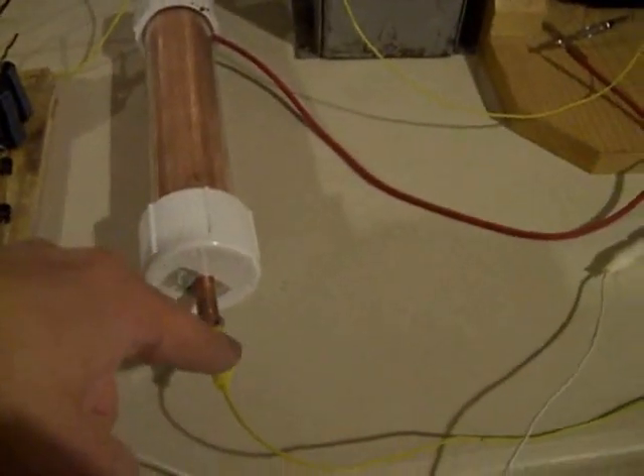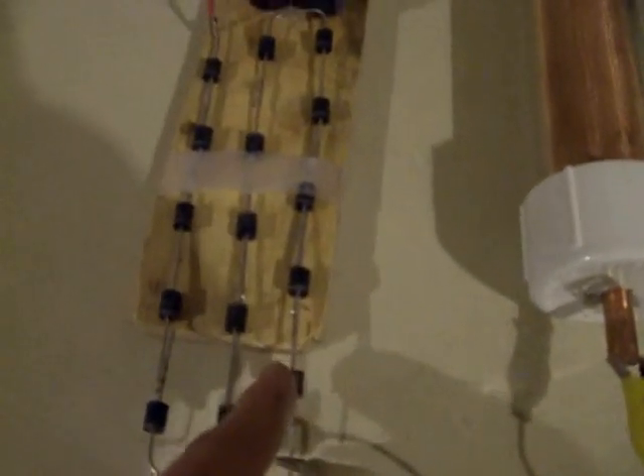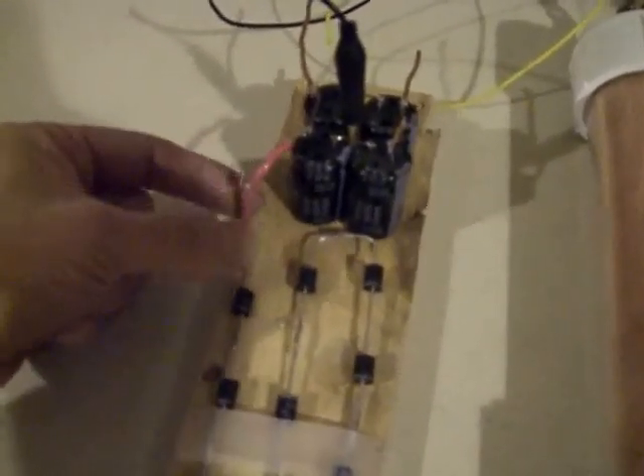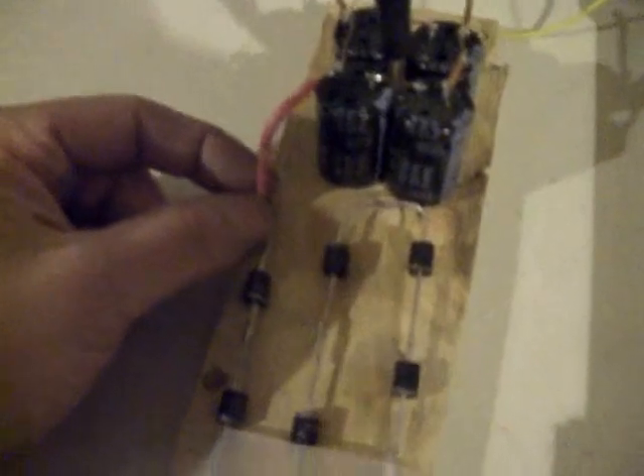Which is 200 volt, 300 microfarads. The negative of this goes back to the ground on the high voltage. So: high voltage positive, to the high voltage rod, to the negative rod, which connects through the switch. On the Graze schematics it's switching right here, and this would be a battery bank. I'm switching on the output side of the diode instead, just because I didn't feel like desoldering this right here.